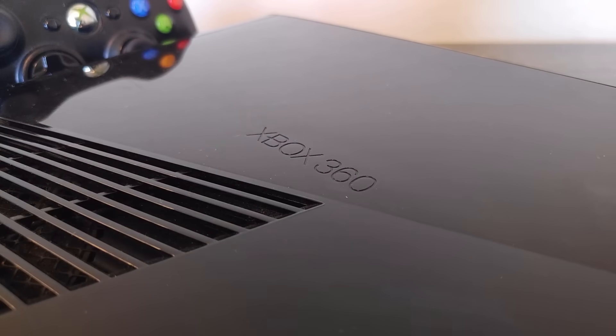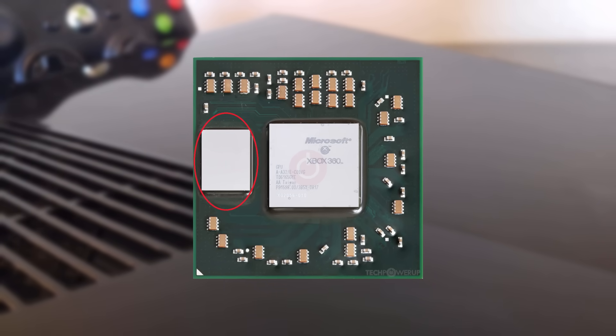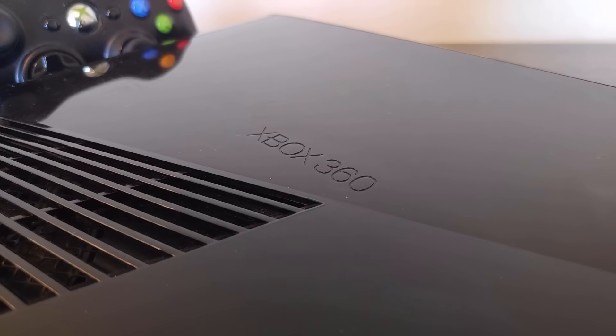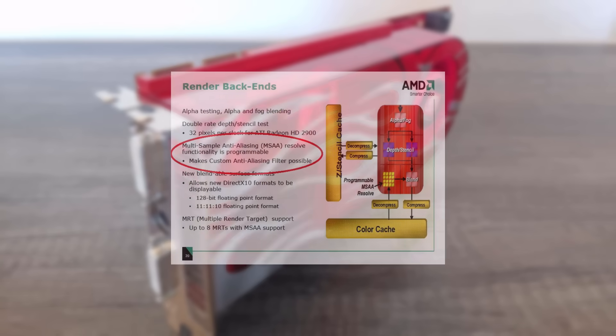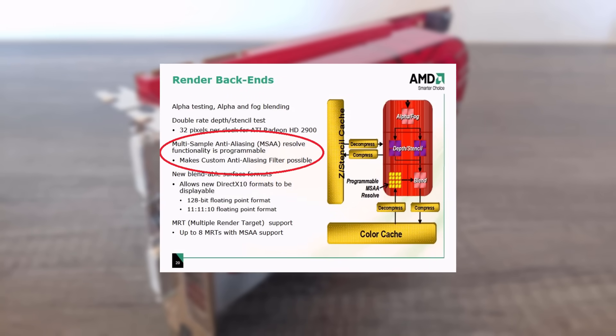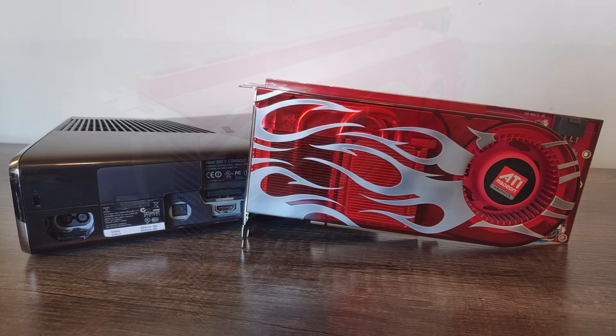The way the chips handled anti-aliasing was quite different. Xenos's AA resolve was performed by additional logic in the EDRAM daughter die, which was capable of doing 4XAA with a negligible performance hit. On the other hand, R600's anti-aliasing hardware was seemingly not present or not functional, as it used the questionable method of doing AA on the shader hardware. ATI's copium for this was that it allowed for configurable AA filters, but this would chew away at precious shader performance and pixel throughput, and in general R600 tends to see a large hit to performance with the feature on.